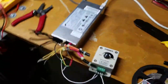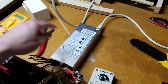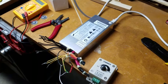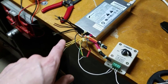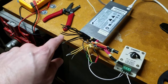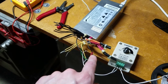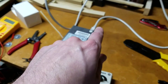For a power supply to run them — these are 12 volt LED strips — what we have here is an old shuttle PC power supply from an old micro shuttle box case, probably about 8 years old. Got all the wires cut down, stripped, and separated into the different 12, 5, 3 volt and ground rails. We have a 12 volt here and a ground. The green turn-on lead is hardwired right now to a ground on the power supply so it turns on automatically when the power is plugged in.